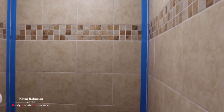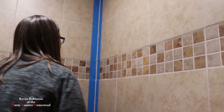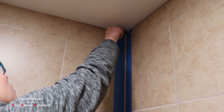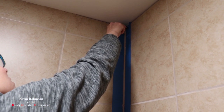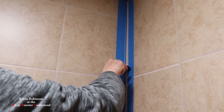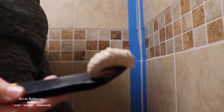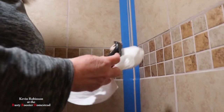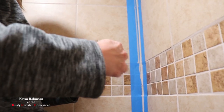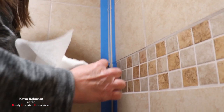That's why I taped it — so we can do this without getting caulk all over the walls, and hopefully it turns out nice. Just take the tool and put it right up in the corner and run your tip down. It does seem like you waste a lot of caulk — as you can see. What do you do with all that? I guess you throw it away. Just keep some paper towels handy to wipe your tool off.